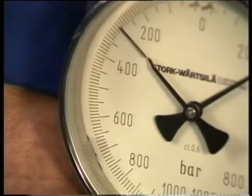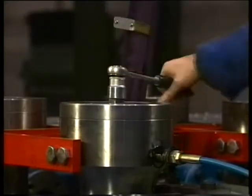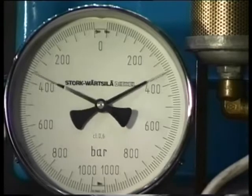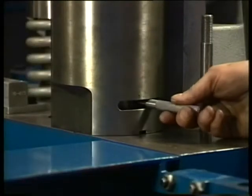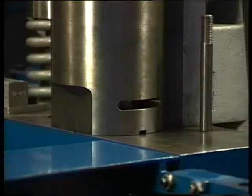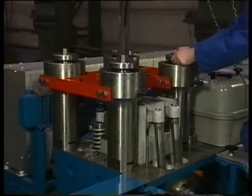Fully release the pressure and turn down the jacks as far as possible. After that bring the jacks for the second time under full pressure. Try to turn the nut farther. Repeat this procedure as a check-up. Make sure the nuts do not turn any farther. After that remove the stretching tools.